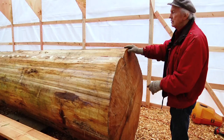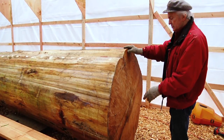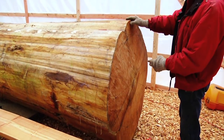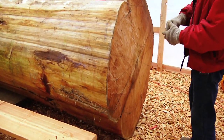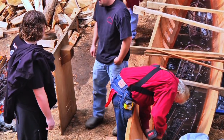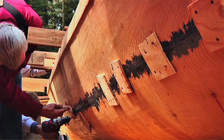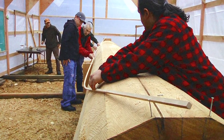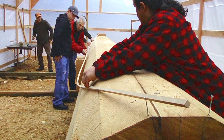It is also a good idea to look for heart checks and to try to keep them from occurring on the sides of the canoe. Checks are also a potential source of splitting during the spreading process. Ideally, heart checks and knots are best positioned in the top area of the log, above the gunnel line, as that area is removed in the carving process.